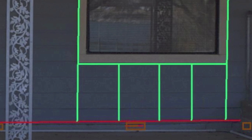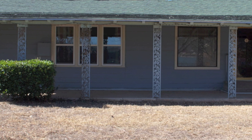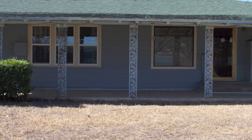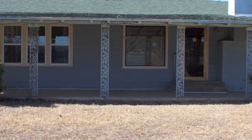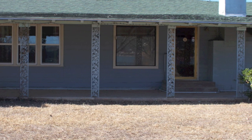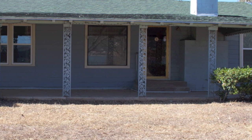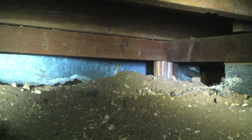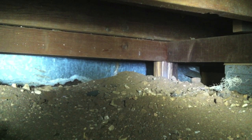The second constraint: the house is surrounded on three sides by a concrete porch with a metal skirt. I can't afford to remove the floor to work safely from above, so I'm going to have to come in from the far side. To get to this sagged area, I have to crawl in with all of my tools. The crawl space is very tight under the cabin, roughly 8 to 10 inches. I had to use garden tools to loosen the soil and a shop vac to remove the loosened soil to get to the sagged area. In short, it is a confined space with limited access.